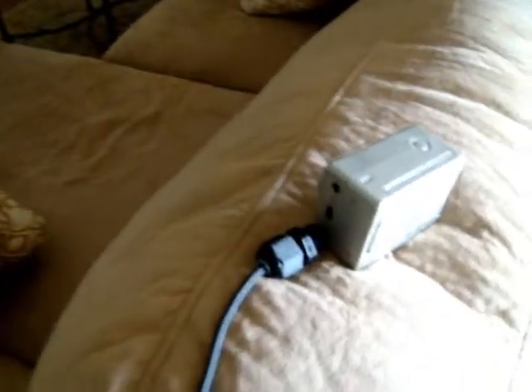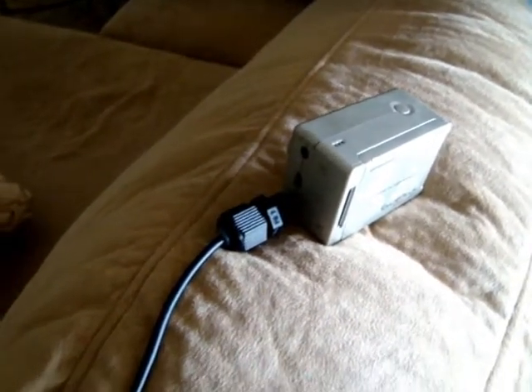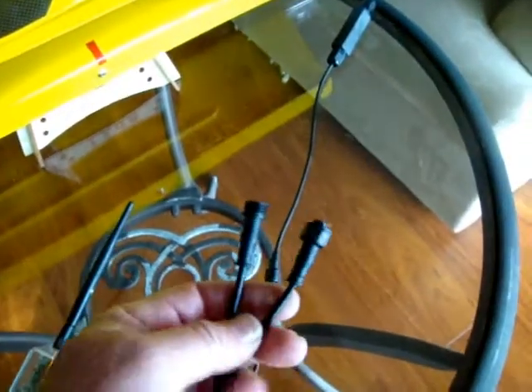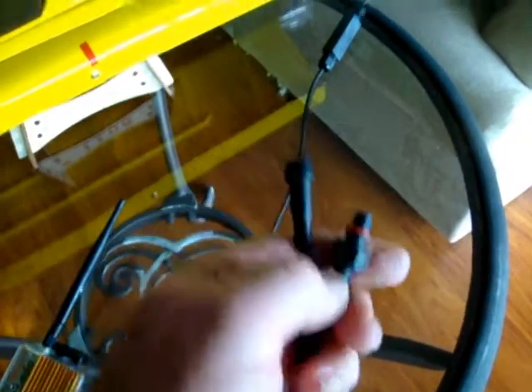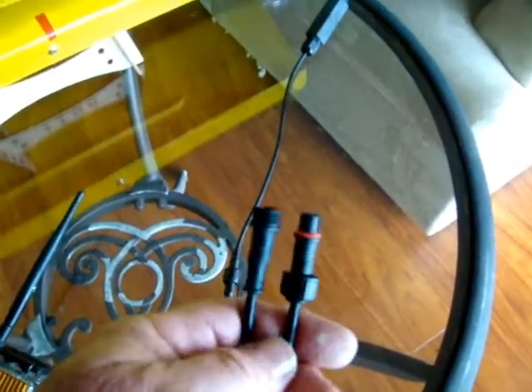What I've done is I've taken the output of the camera. There is a watertight fitting which I can embed into the housing. The cable comes down to a junction box, which allows me to connect into a 4-pin waterproof connector. These are O-ring sealed connectors with a depth rating of about 180 feet — I have used them extensively for marine research around the world.